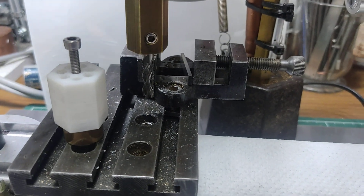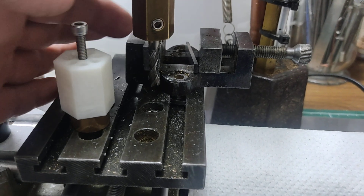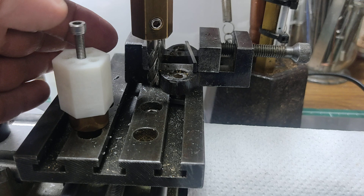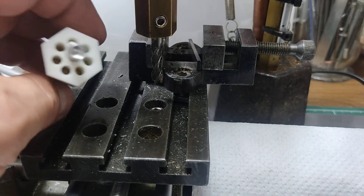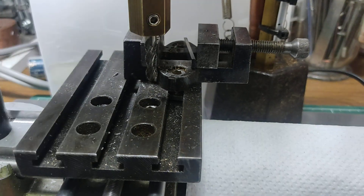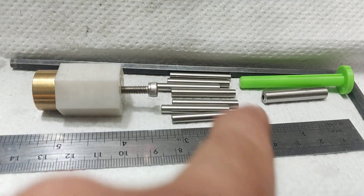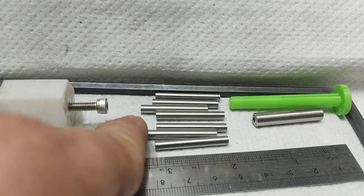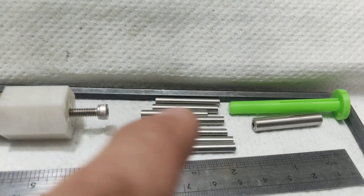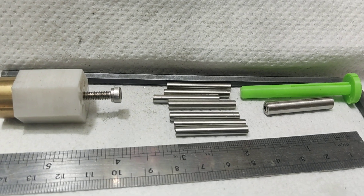This is the setup. I made sure the vise is moving along basically the Y axis, indicated it in, and tried to machine these using a six millimeter end mill. Well, results were mixed — three of them were in spec at plus or minus 0.05 millimeters, which was wonderful, but the rest were horrific, ranging from 0.3 to 0.7 millimeters off.